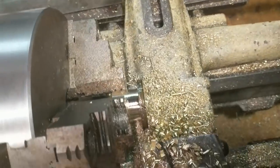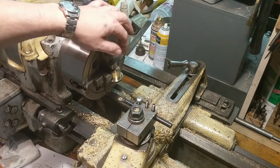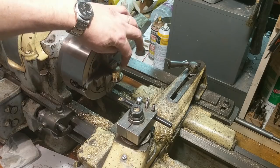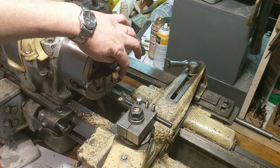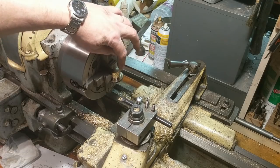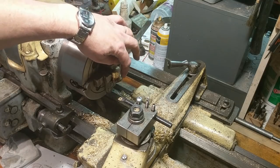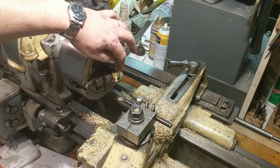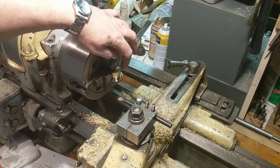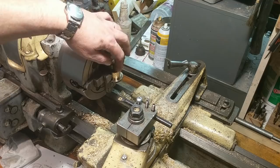Next is to get this thing mounted up in the four-jaw sideways. Having it in the four-jaw now, I need to trim this flange down to a total width of one inch and trim the barrel part down to seven-eighths of an inch wide. I'll begin with the barrel part — touch off with the boring tool and then feed in 63 to 64 thousandths off this edge. This is one inch, so 64 thousandths off each side should get me to about 0.8725, which is where I want to be.